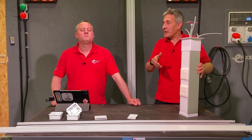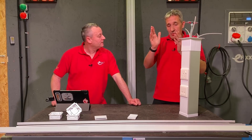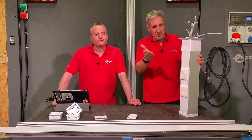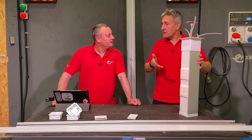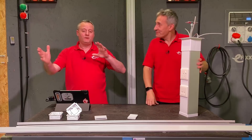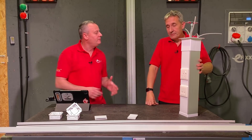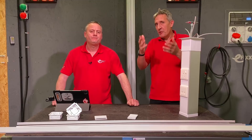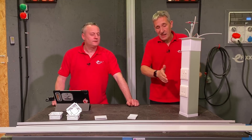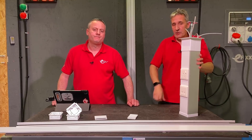If you think of factories, particularly ones in electronics or clean room conditions where you want to bring lots of services down to a machine, I've used these with obviously power, data, and then some of the other things that machines use — compressed air and some rare gases. And when you say clean, you mean removing all those trip hazards from hoses on the floor. Yeah, or sometimes people make their own efforts with basket and cable trays, but a power pole in those scenarios can actually be a great solution.